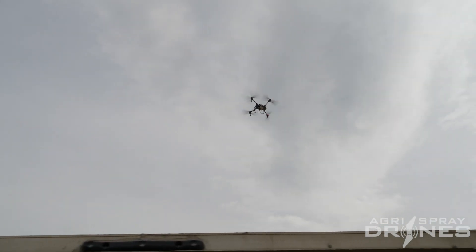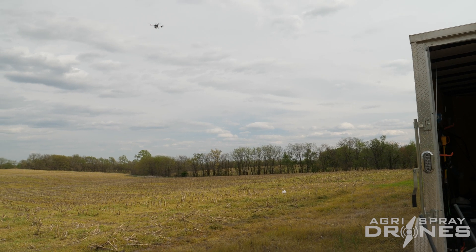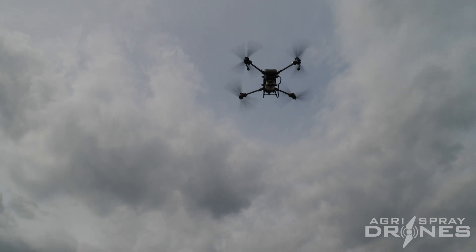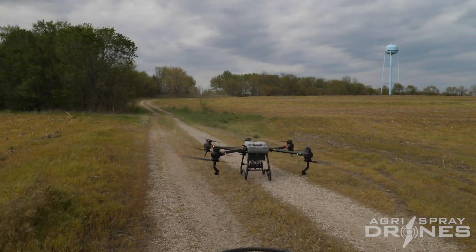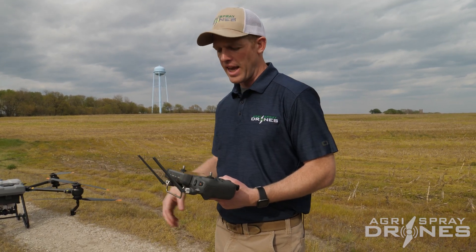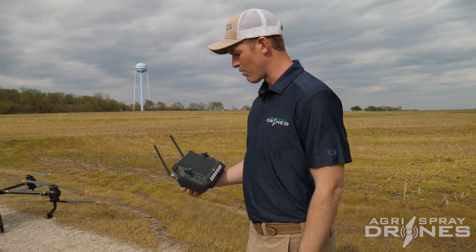There's one more full line, then it turns around, flies diagonally, and does the last line. It just took the last picture and now it's going to return to home autonomously — depending on your settings, it may or may not do this automatically; we have it set to return home. Now it's going to start stitching these images together. It's important to remember that you're operating on RTK for this mode, so the T40 will land by itself. It has precise positioning and knows exactly where it took off from, so it goes back to that exact spot and orientation and lands without you telling it to make that final descent.